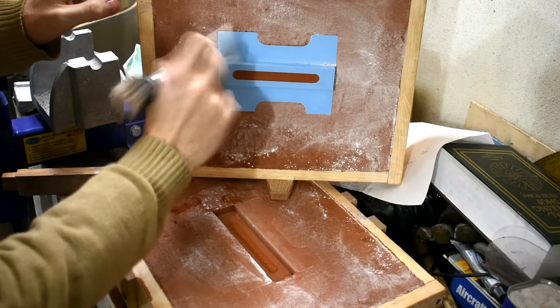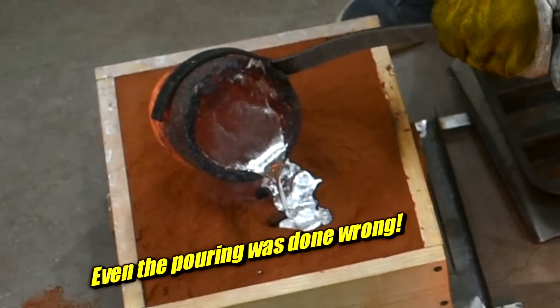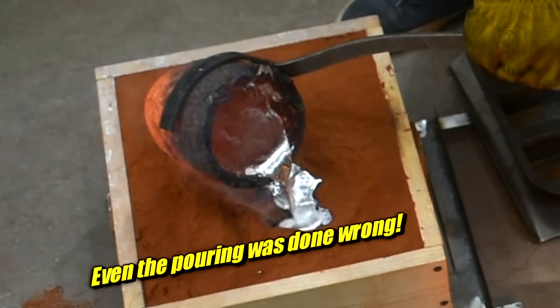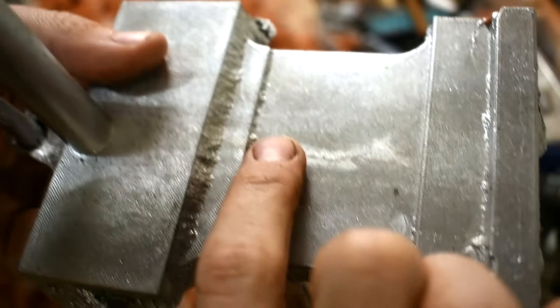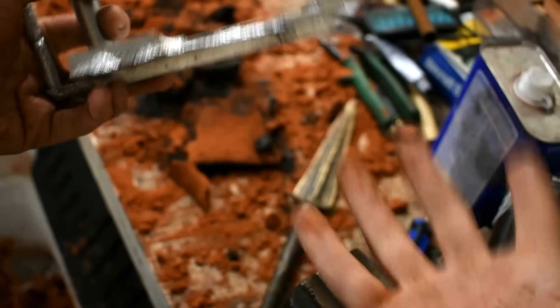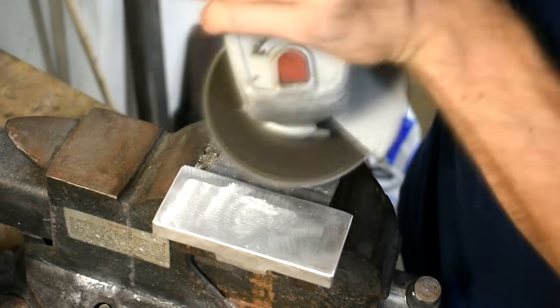Last time I attempted to make a Gingery lathe, I cast it and got this. Do not blame the pattern for how crappy this looks. This is made from scrap mystery aluminum, which I guarantee I poured way too hot with terrible gating and terrible technique. I did have some knowledge of shrinkage and tried adding a feeder to combat that, which was too small and did not work. You can see what it got me: sand inclusions, air bubbles, a shrinkage crater that not even excessive grinding can fix. We're going to take a closer look at this later, but let's address all of these problems this time and compare at the end.